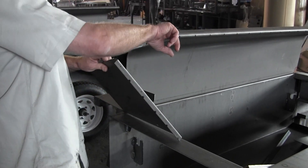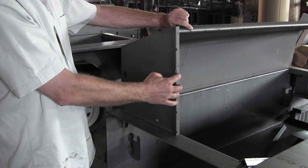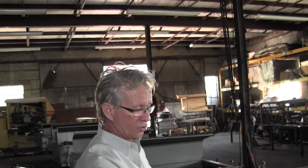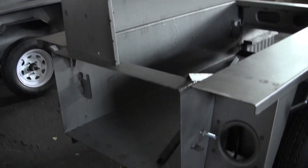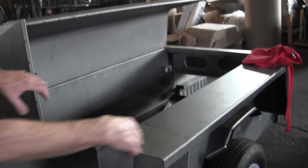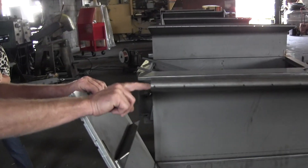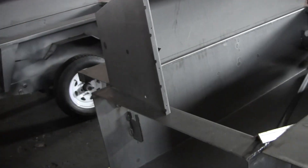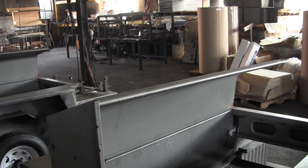The Tucker has a gasket that goes up the side and around the top, so these places on the Tucker grill have to be perfectly lined in the correct position so you have the right gap. We actually have a fixture that goes in here and holds this gasket seat and this hole exactly in line with each other so we maintain proper alignment.